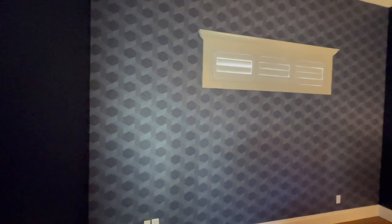And if you're hanging this product, be very careful because the overlap, in my opinion, is ridiculous. A quarter of an inch, and you have to be so precise. On a wall that's very tall, the wall covering isn't always perfectly plumb. Sometimes it's an eighth of an inch off. That's not a lot, you can't see it. But they're only giving you two eighths of an inch, which is a quarter. Okay, so there you have it.